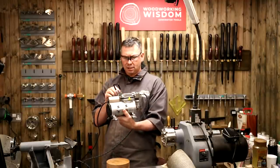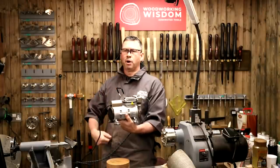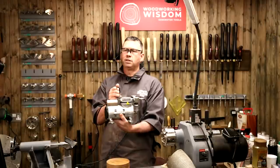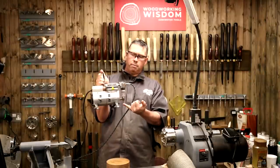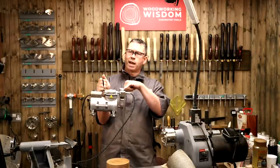But that one, it's silent. I'm right next to it with my mic, but that's all it's doing. There's no tank on this one. So the way it does the pressure is continually running. It dumps air through this little valve here. So if I put my finger on that, that's just stopping the air coming out. But that's how it regulates.